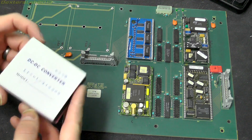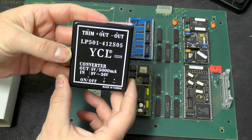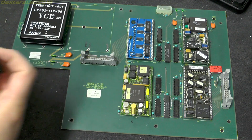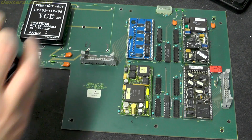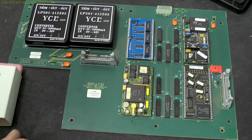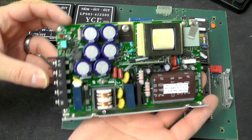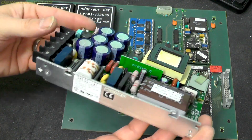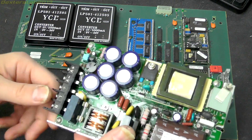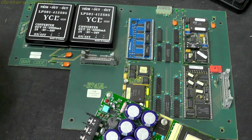I've had another rummage around and found these DC-DC converters which are a bit beefier — 5 volts at 5 amps. I'm planning on installing two of these, wired as plus/minus 5 volts to sort out the DC side. For the AC side I'm going to use a frame power supply recovered from a piece of equipment: it's 12 volt output, so I'll run the mains into that, have the 12 volts come up onto this board, and then these DC-DC converters will drop it down to 5 and minus 5 to power the circuits.